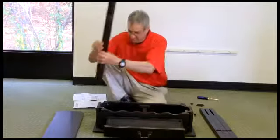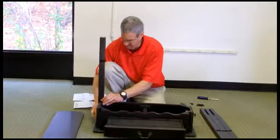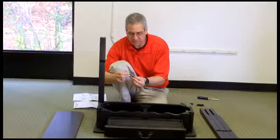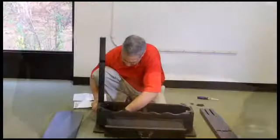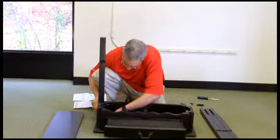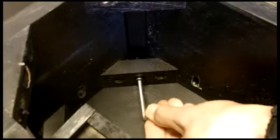To start, we'll take the first leg — they're all actually identical. The most important part when setting it in is you want the groove to be inside, just like this. I have the first bolt with the larger washer and the lock washer already attached. I'm screwing it in with my fingers first, then using the allen wrench just to tighten it snug.